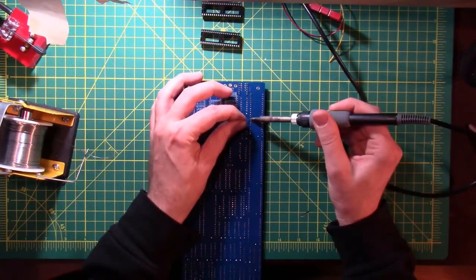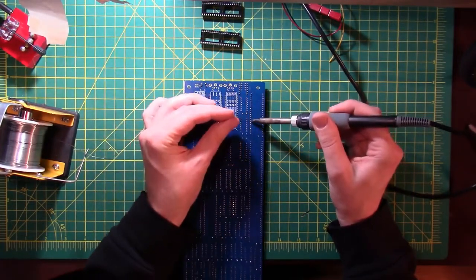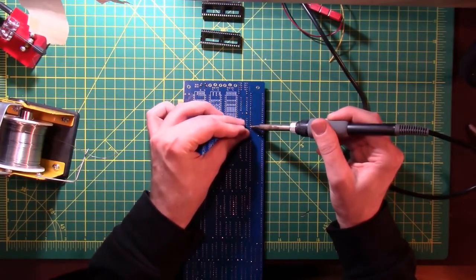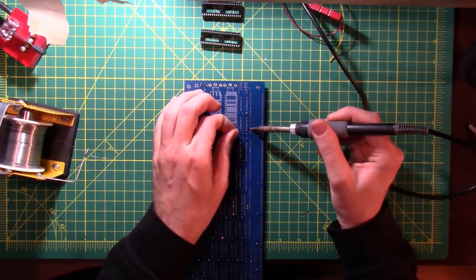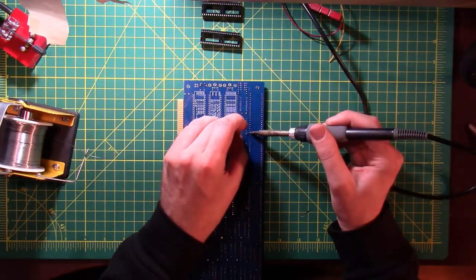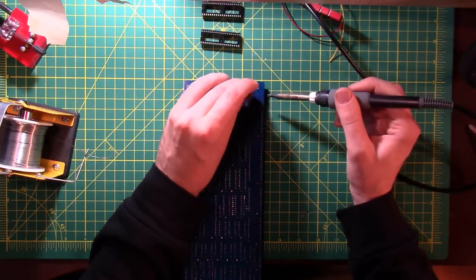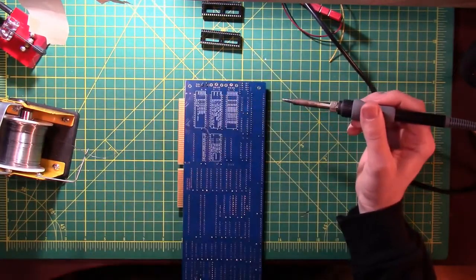So what you wind up doing is desoldering the whole socket, which, unless you have a desoldering iron, which I don't currently have, I am accepting gifts, however, is a real pain to do with one of those solder sucker devices or the soldering iron with the squeeze bulb on it. I had to do some desoldering of single row header sockets and single row pin headers in another project. What I wound up doing was disassembling the pin header or the socket from the pins.